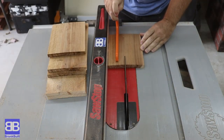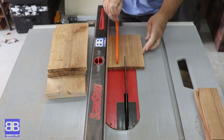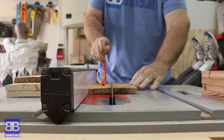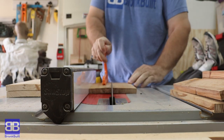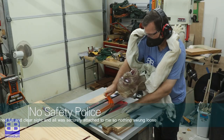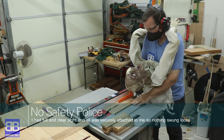Each jack-o-lantern would have had three pieces cut at its specific height — that would be one front, one back, and the remaining piece would be used for the sides. I now take the remaining piece from each of the six jack-o-lanterns and rip them into two side pieces. Rather than try to rip them exactly down the center, I simply rip them at 2.5 inches each.